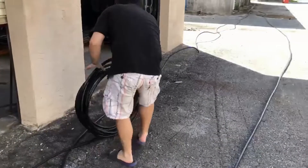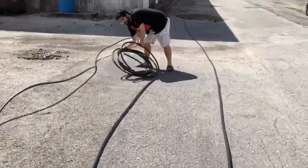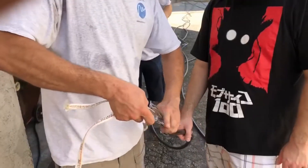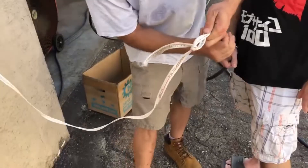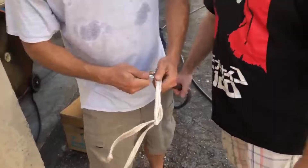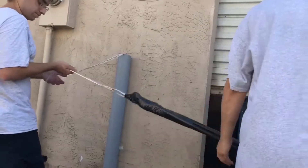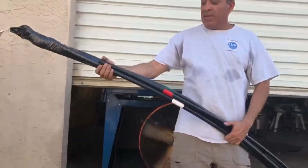That's a pretty thick cable, so I'm going to cut it one by one because it's aluminum and lightweight. To distinguish the cables, Tam is putting different color tapes on them. This is going to be a three-phase service. The colors we're going to use are red, black, blue, and for the ground we're going to use green.